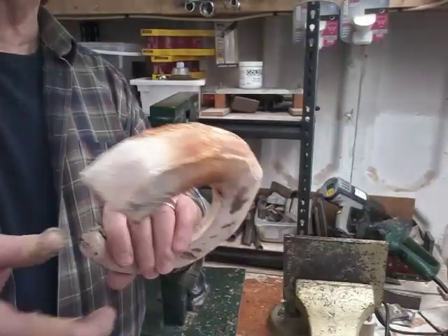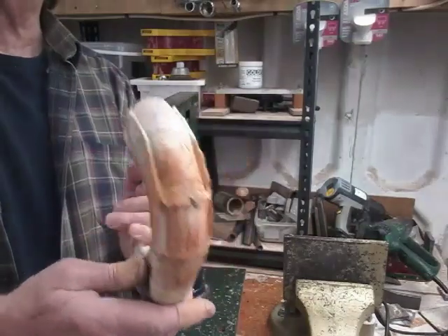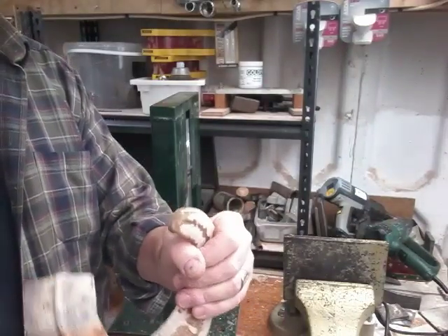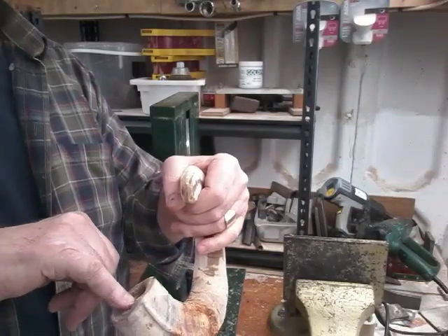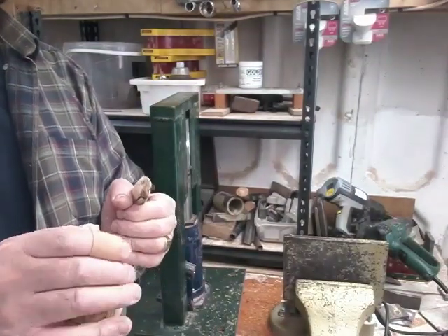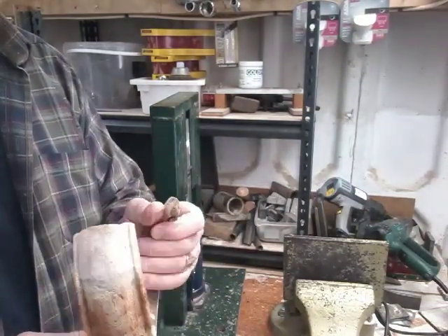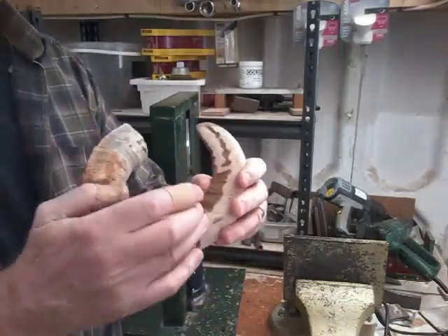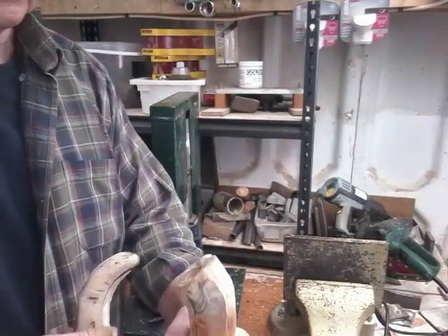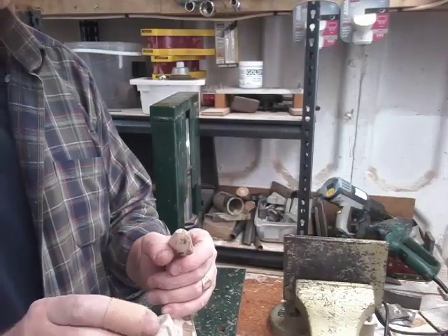You can see what's happening now — we're squeezing up and we've changed that flat cross-section to a more rounded one. We've got some ridges but that's the bottom shell digging in, so that'll be ground off. I want to make this horn just a little bit bigger here because there's a tiny little crease in there — I want to get rid of that and then squeeze up again on that. All this horn wants cleaning up a bit. So far we're going okay, but when we get to the thinner area things might change — we might have to go from this down to a vice.